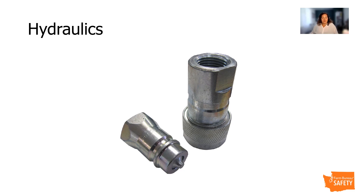For many years, hydraulic connectors have been standardized so that all hydraulic implement lines can be coupled to all hydraulic outlets on the tractor. Before connecting, make sure you clean the male and female portions of the fittings. Do not operate the tractor hydraulic controls until the circuits have been completely connected. Although most tractor hydraulics will allow implement fittings to be connected under pressure, leaving an implement with pressure in the hose is very dangerous — temperature change can expand the oil and increase the system pressure. Once connected, test the equipment to ensure the components move as expected, and then properly maintain the equipment according to the manufacturer's recommendations. During transportation, engage the transport safety locks to ensure the hydraulic components cannot accidentally move or be activated.